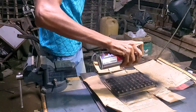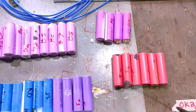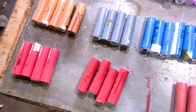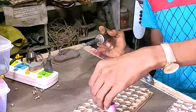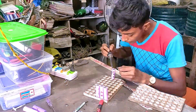The cells from the laptop batteries were all different, so I categorized them into groups of similar specifications. If you want to know how I did that in detail, head over to my Patreon page — we can have live talks there to clear up any questions. After all of this, we can finally tin the cell terminals with solder using a powerful soldering iron of at least 60 watts with a thick tip, which is a must here.